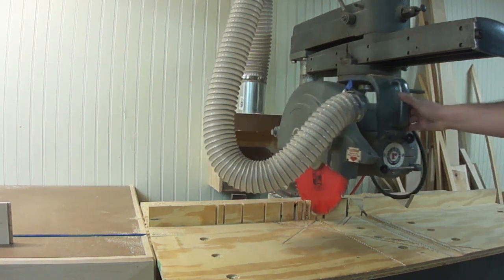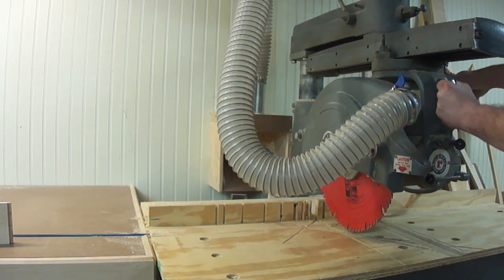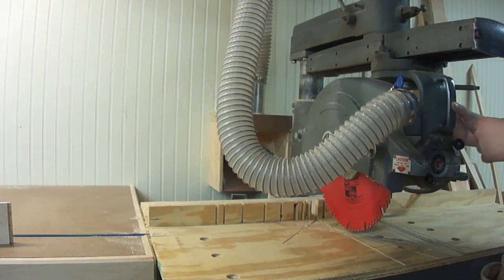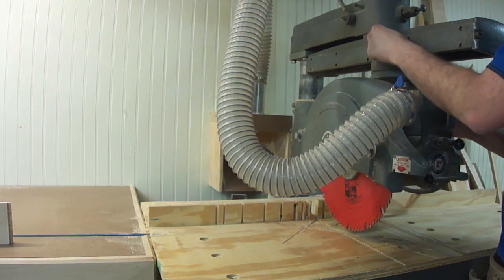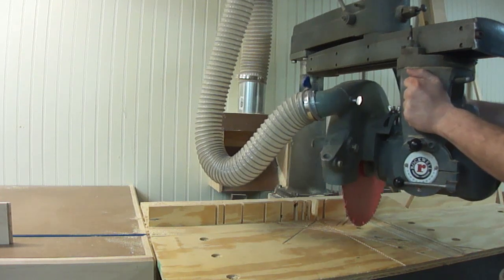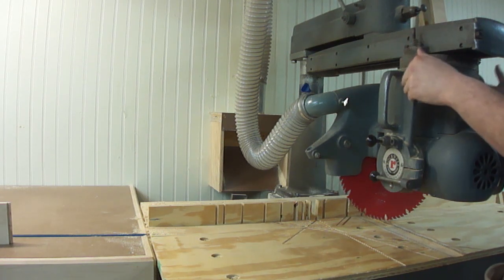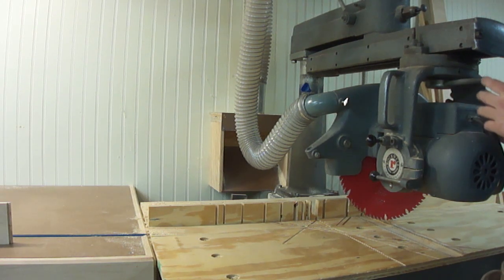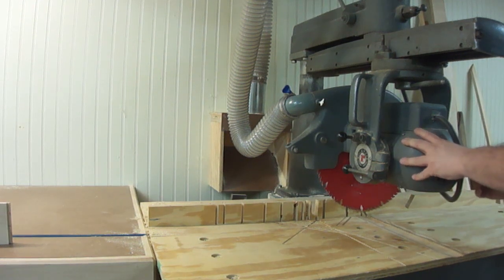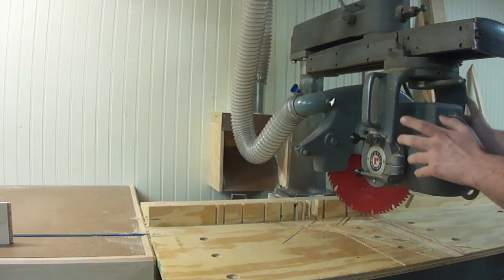Now I want to pull this thing out. There are two things I have to do to move it into ripping position. There's a locking clamp for the yoke assembly — I have to unlock that. And then there's this pin that works a detent to lock it at 90 degrees; I have to pull up on that and rotate the yoke. Now I can turn it, pull it away from the fence a little bit, turn it some more — and the pin just dropped down into the new location, setting it parallel to the fence. I always like to do a sanity check by pushing it back up against the fence and making sure the blade truly is parallel to it, because if it's not, it'll either burn the wood or kick it right back at you. And neither one of those things is ideal. At this point I can go ahead and lower the saw back down.